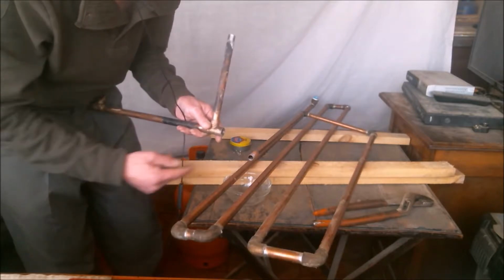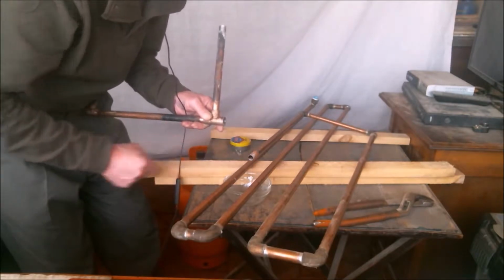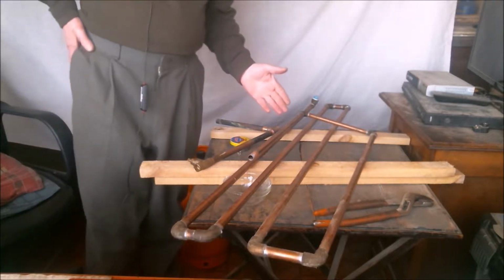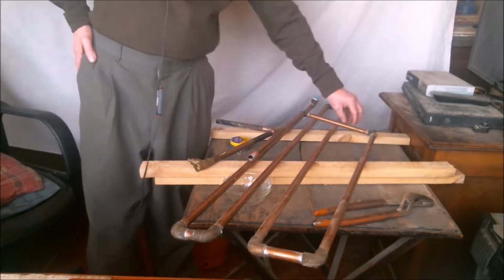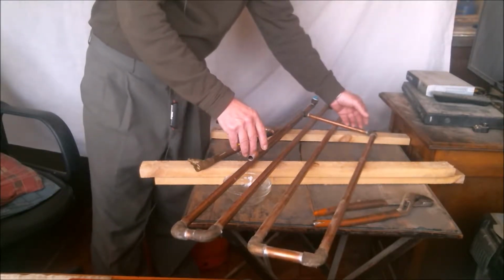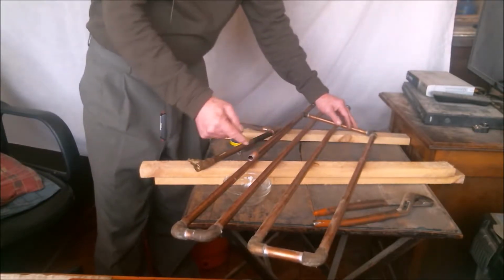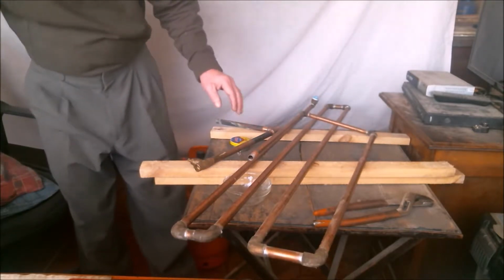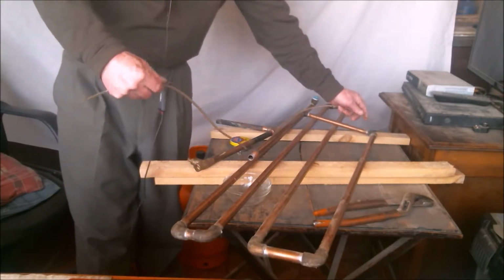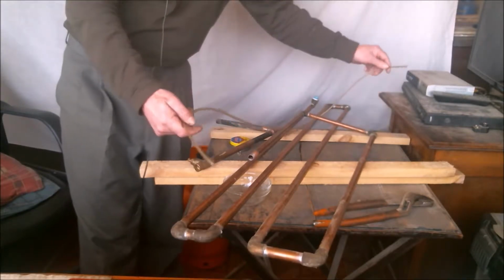So, the first thing we must do is eliminate any humidity or water from this length of pipe. Sometimes just opening a faucet will stop the dripping, letting us solder. If we have a stop valve over here, before this end, we can dismantle the stop valve and blow through the piping, dislodging most of the water. If there is no stop valve, we can suck or siphon the water out with a plastic tube, pushing it in as far as possible. We suck and spit and eliminate all water we can reach in the length of piping.